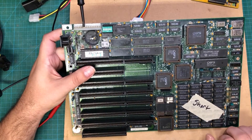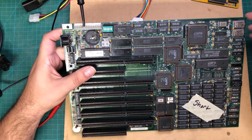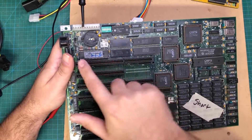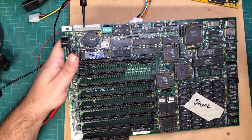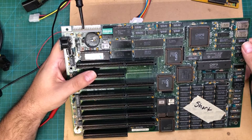As you can see, I've got this board and it says that it has a short in it. I've shown a few things about shorts on motherboards before. The first thing you want to check is go through all the slots and make sure there's no gunk in there, and just look around the board physically for anything that looks bad — these tantalum capacitors being blown, anything like that.